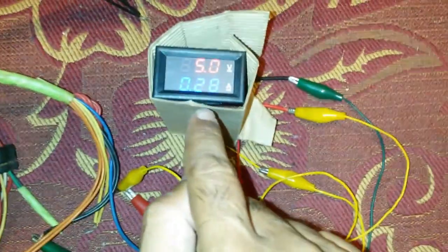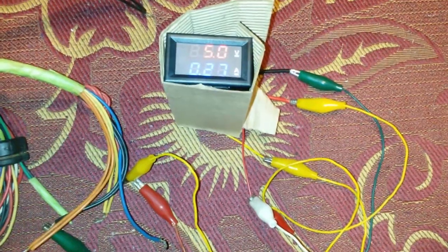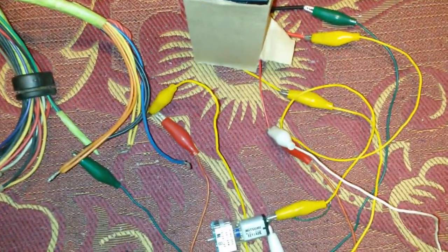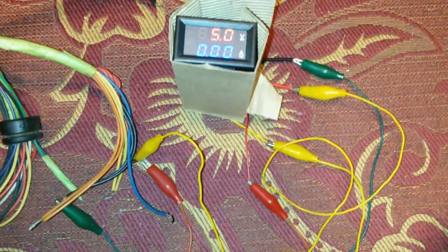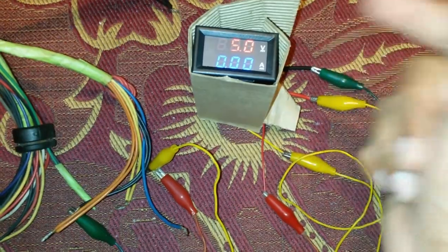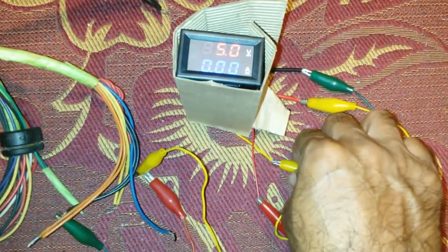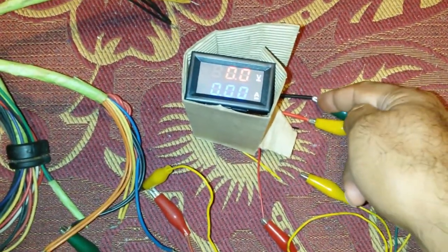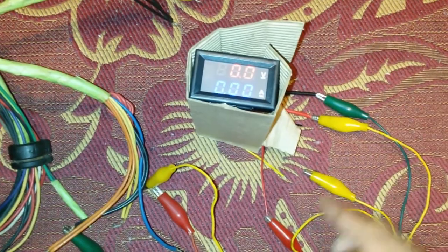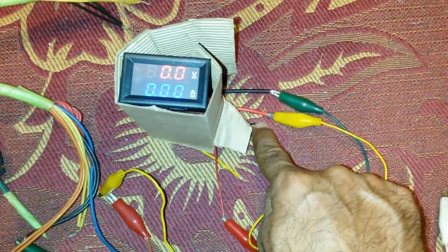And it does, and it's saying 270 mA. Makes sense. We're in the whole pump here, so there's no point in trying to show it's working. Take it off, 0. Voltage still being measured. Let's disconnect our voltage sensor. Take that off, 0. Power is still running through from this side and this. It could run through also this ground.